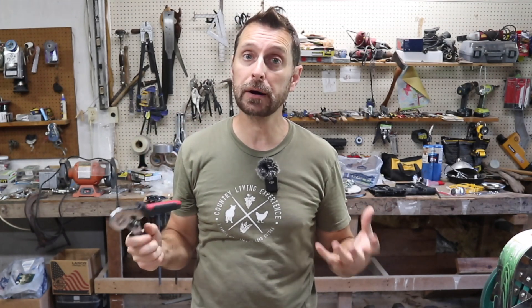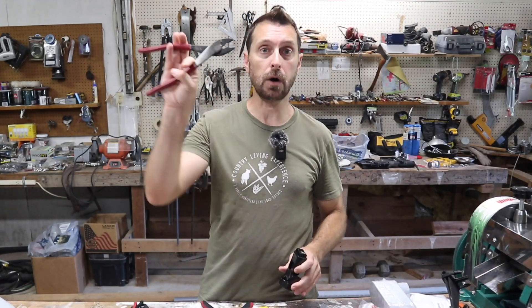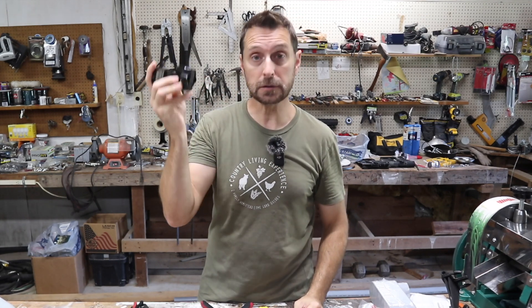Since I just mentioned the crimping tool, let's talk about specialty tools you may need for your job. For us, when we started all of these projects I needed a few specialty tools I didn't have — I believe I spent about $135 on all of these tools. The first one is a large battery cable stripper, which is really nice. I'll list all of these tools and parts with prices in the description below. Along with that I needed a small wire crimper and also a large battery cable crimper — this is the cheapest one you can get and just uses a spring and the force of a hammer to smash down the ring terminal. I had an old multimeter but for a project like this you really need something a little more professional — this Klein clamp meter was about $50. It's got a lot of different functionality and doesn't break the bank.